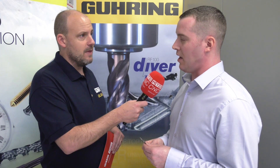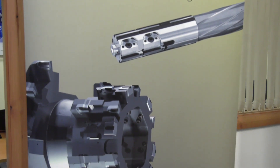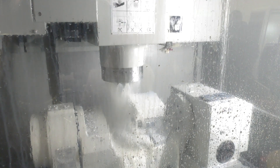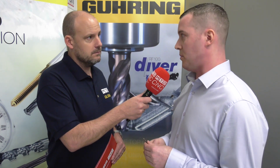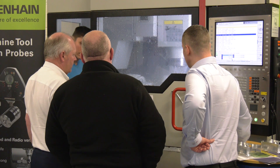And not only aluminium — it also works on plastics, bronze, brass, and any non-ferrous materials. We're actually running this drill here at the Engineering Technology Group today to showcase it. It's running at about 350 metres a minute, with a feed rate of about 0.25mm per revolution, which works out to around 4 metres a minute feed rate, straight in — no pecking. A pretty good demo with lots of interest.